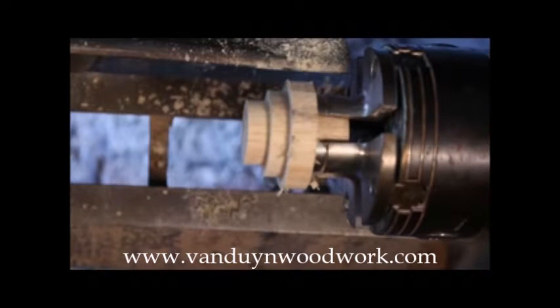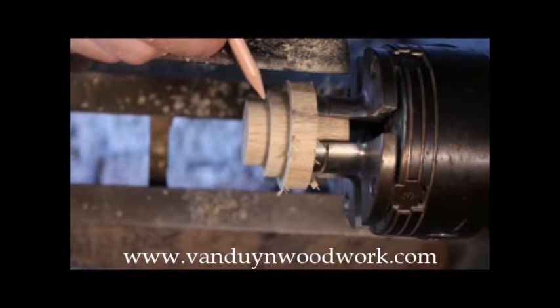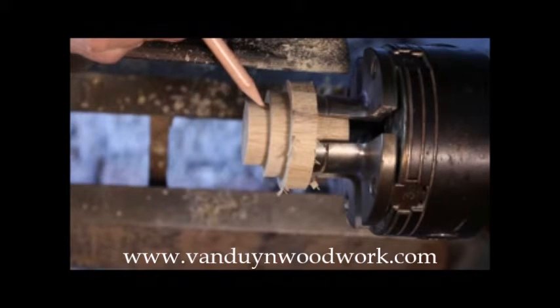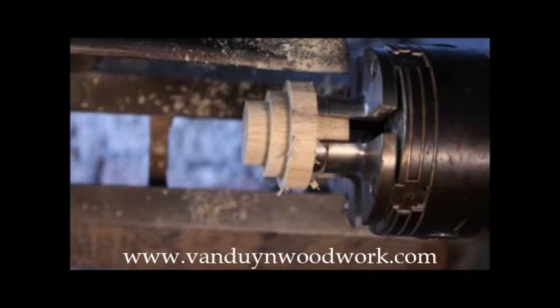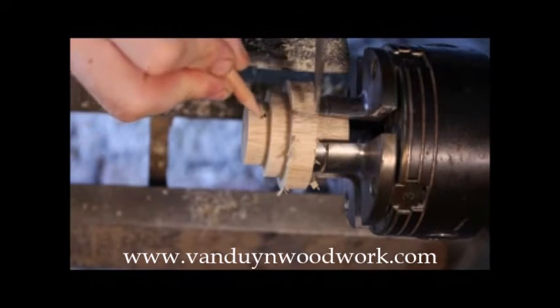Okay, so here are the important things for cutting your threads. First, you're going to need to put a chamfer on this edge right here. You do that so that your thread chasing tool has something to start indexing its threads to. The other thing is you'll take your parting tool and part in an area that's slightly smaller diameter than what you expect your threads are going to be, so when you're running your thread chasing tool across here you're not running your threads right up into the shoulder. I'm doing about a width and a half on my parting tool — I've got a small handle with a kind of shallow curve. You're only going to do just a little bit, and then this area will be where you cut your threads.